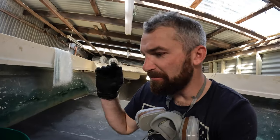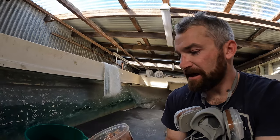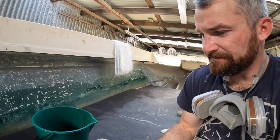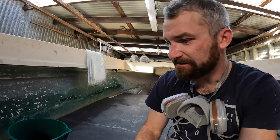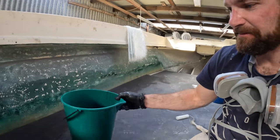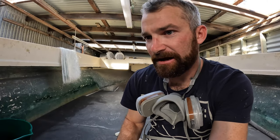and resin. And what I'm about to do is lay a radius around the corners with cabosil and resin. And that's sort of your peanut butter mix, I guess, whatever you want to call that, but that's cabosil and resin. And I've got some VE resin mixed up with some chop strand mat ready to do some tabbing on the edges, so over the top of that radius.